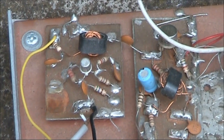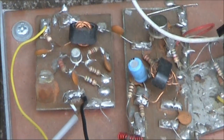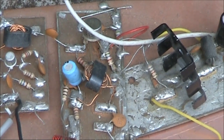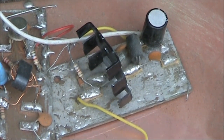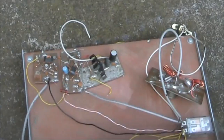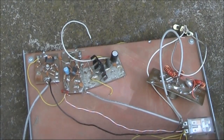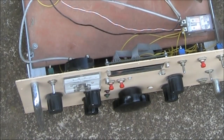On the left is a transmit RF amplifier that amplifies the low-level signal from the diode mixer. Then, as you can see from the bigger transistor, a bit more power — maybe 100 mW. And then a BD139 stage, which would be fine for 160, 80, and 40 metres, to give maybe 1 W. This is very makeshift and I will no doubt rebuild this stage. There will eventually be a higher power RF amplifier as well as switched low pass filters, likely with a relay each, with the voltage coming from the rotary switch used to switch between bands.